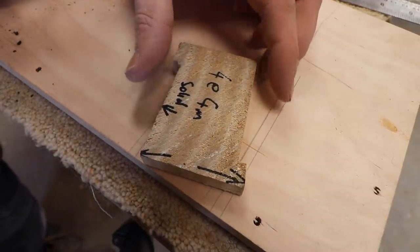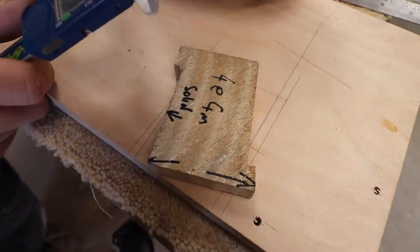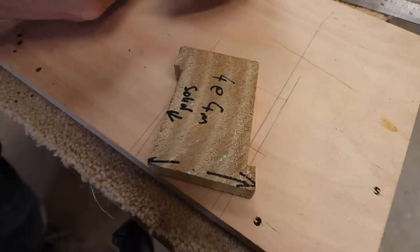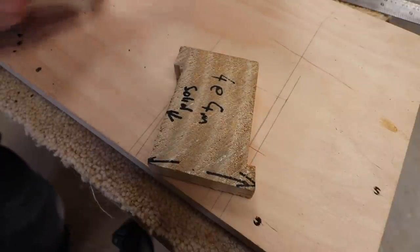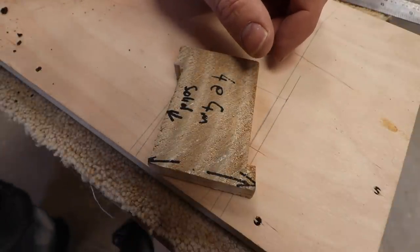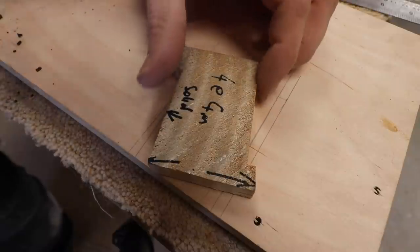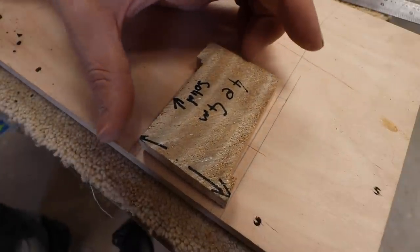Now, as we're making these out of accoya, we've got 4 meter lengths. I didn't want to go and buy a 3 inch thick piece of timber, so 76 mil thick timber, and rip it down, because you're just going to waste a load of accoya and it's going to cost the earth. So we bought 2.5 inch timber, which turns to about 65 mil. I'm going to plane it up to see if I can get the 65 mil, but if we can't get it, our plan of action is to machine this slightly differently to normal.